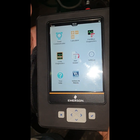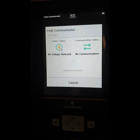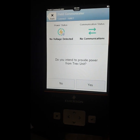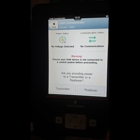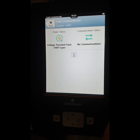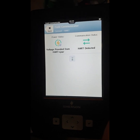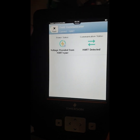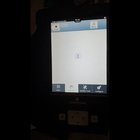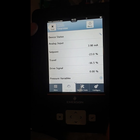Go to the field communicator — you can see it loading. We have to select HART. There is a warning: we want to pass power from the HART communicator. Select the positioner. Here we use the HART plus power terminal, because we are using the power from the HART communicator, not an external power source. You can see it is already connected to the positioner and showing the connection status.